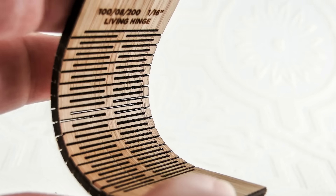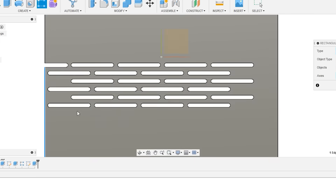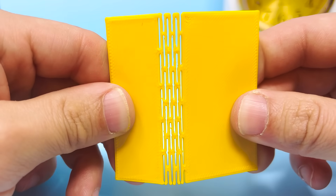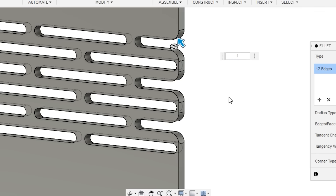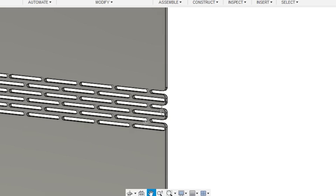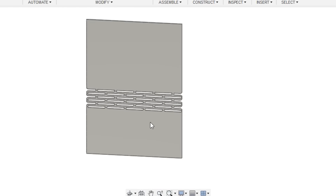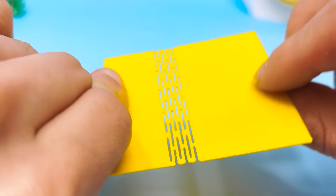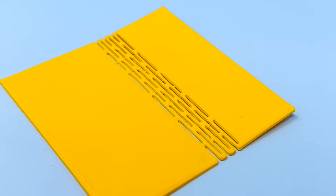This is a good way of creating long articulated columns or multiple hinges inside the length of a long thin part, so you don't have a single plate of wear like a traditional living hinge, but you still have a good amount of flexibility. One of the more traditional hinges is the living hinge you might have seen in woodworking — where you cut individual slats inside of a horizontal plate. Those individual slats are able to twist and bend around each other, and by creating that twisting motion and freedom, you're able to create something really flexible.